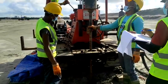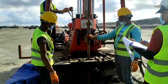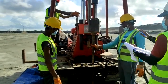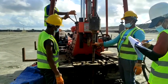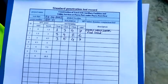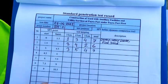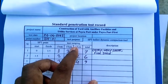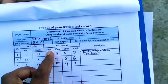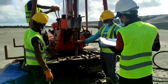In this way we will repeatedly do the work up to the required depth. Every 1.5 meters we will do this hammering and take the sample. The sample and envelope will go to the lab for further soil testing. This is our data sheet — every 1.5 meters we do the same test. The three intervals are 15 cm, 15 cm, and 15 cm. For the N-value, we do not count the first 15 centimeters, as per standard practice.